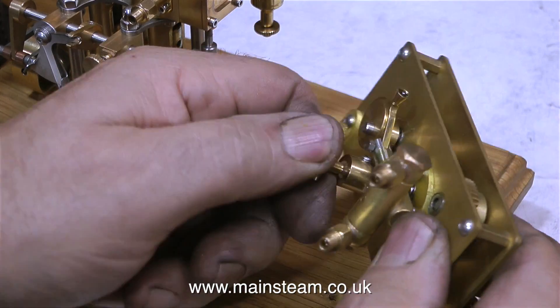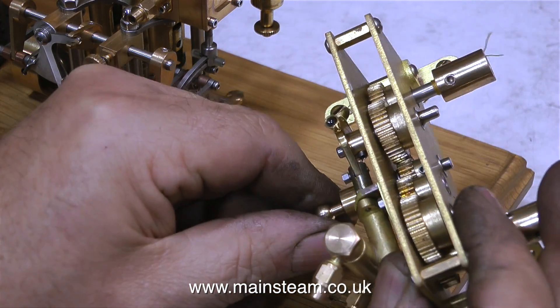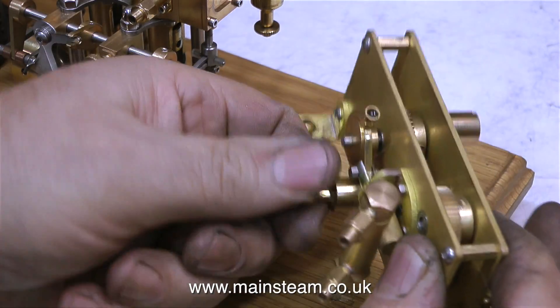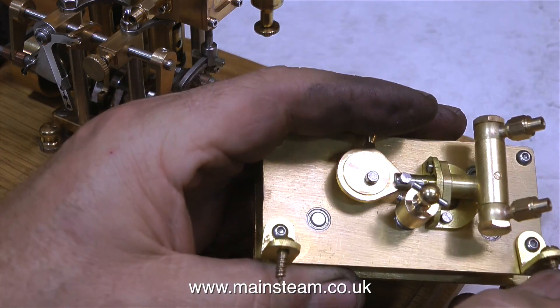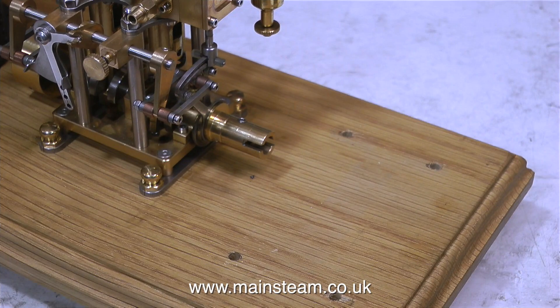The screws are jammed in the brass angle that supports the gearbox, but the screws just sit in holes in the baseboard — they're not actually screwed into the wood at all, and it doesn't rotate. The coupling was fitted too close to the water pump, and all I had to do was move it forward on the shaft. So now at least the gearbox rotates.